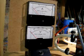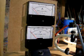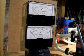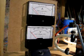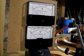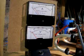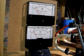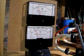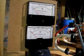This is a demonstration of how the two meters respond to varying loads on the tank. With a crucible load in the tank coil, I'm going to turn the power level up using the buck regulator knob. You'll see how the link current and the tank voltage both increase in unison as I adjust the input power.